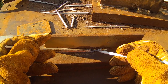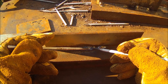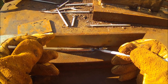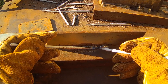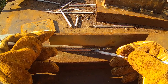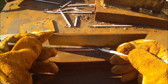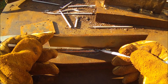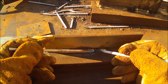Here's a better idea. See this? See where the crater is? That's where your arc is, that's where your filler metal is — so that's what you want to be watching. There'll be a dark semi-circle there. Sometimes it's shiny against dark, sometimes it's awful hard to see. You're seeing through the hood what I'm seeing. That tells you how high that bead is, and it gives you an idea of how fast you're progressing. If you lose that dark line back there, it means you're moving too fast — you've outstepped your puddle, you're going faster than your puddle.